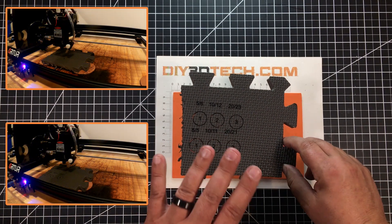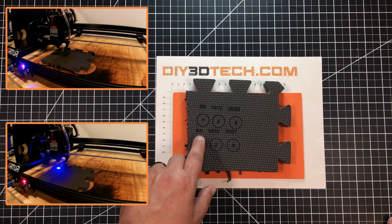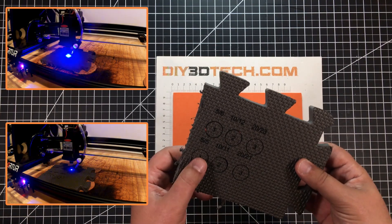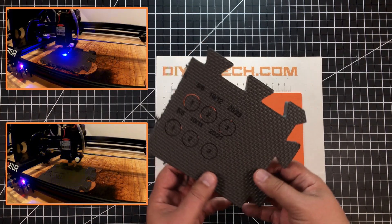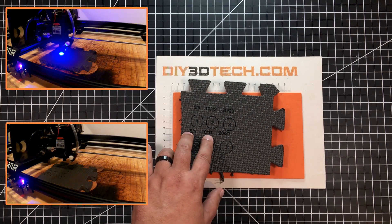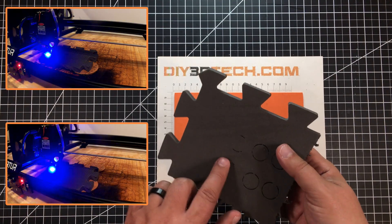Before doing this piece I completed a couple of setups to get me close, then ran test cuts. Starting at 5 mm/s at 5 passes, 10 mm/s at 11 passes, and 20 mm/s at 21 passes. I can pop out the first two — the 5/5 and the 10/11 — but almost none of the 20/21 is cut out. I typically double a successful recipe, so I knew 10/11 was good, went to 20/21 — twice as fast with nearly twice as many cuts — and as you can see, it did not go through except for a small piece.